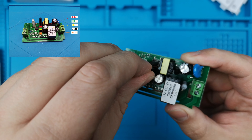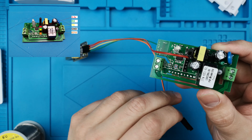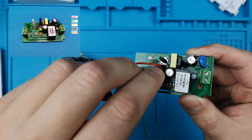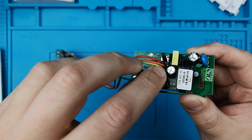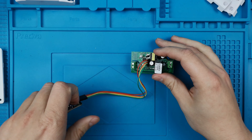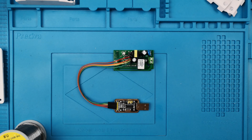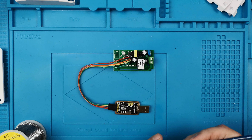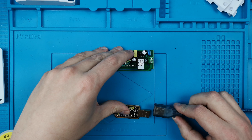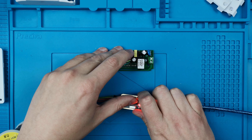If you are using a serial adapter which supports both 5 volt and 3 volt, don't forget to put the jumper on 3 volt. On your serial adapter connect the ground, the RX, TX, and the 3 volt to your jumpers. Then on the Sonoff Basic connect the four wires: the first at the top is 3 volt, then RX which must connect to the TX of the serial adapter, then TX which connects to the RX, and finally the ground.